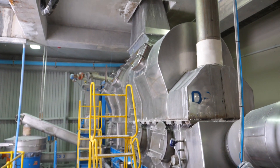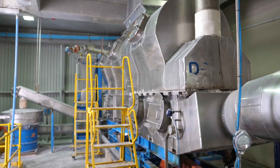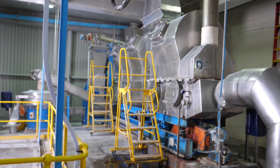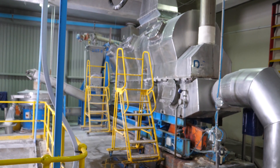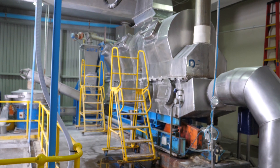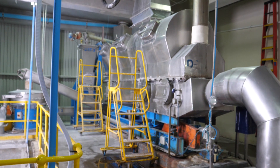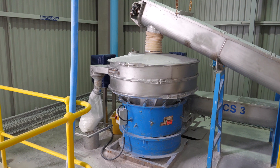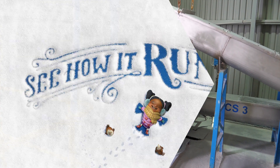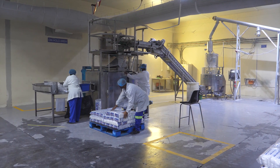The salt drops down into the fluid bed dryer. In the fluid bed dryer, hot air is blown through the inside of the machine and the moisture content of the salt is further reduced to about 0.05%. The salt is cooled at the end of the process and iodine and a free flow additive are added. The salt is stored in silos from where it's fed to the packing area.